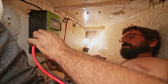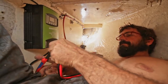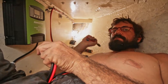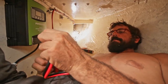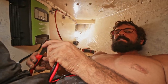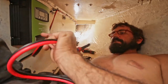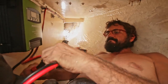Everything's hooked up all the way to this stage. If I went ahead and cut through both of those now — the solar is producing open-circuit voltage, which doesn't harm the panels — but if I suddenly went snip across positive and negative simultaneously, I would actually bridge it for a little while, and I dare say a few sparks and some smoke would come out of there. So I might just cut them one at a time. That seems like better policy.